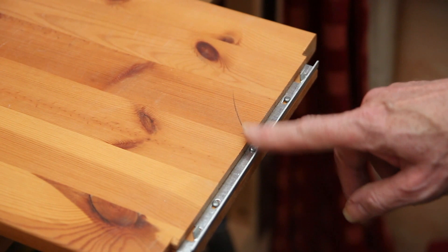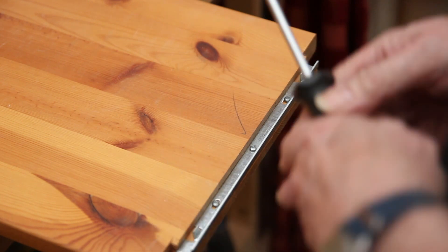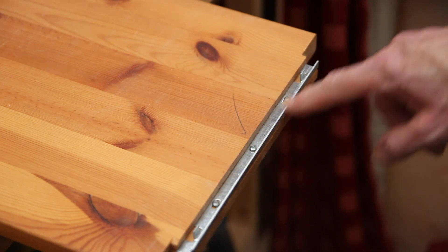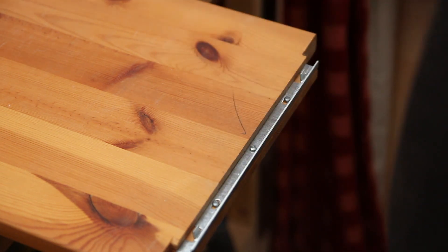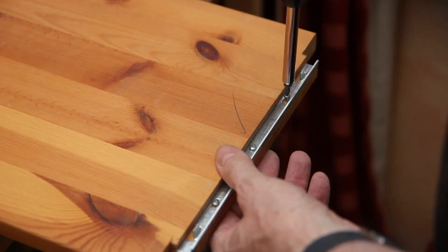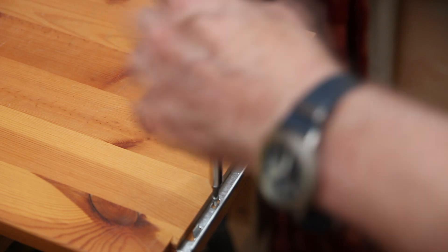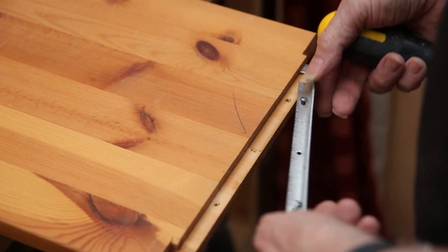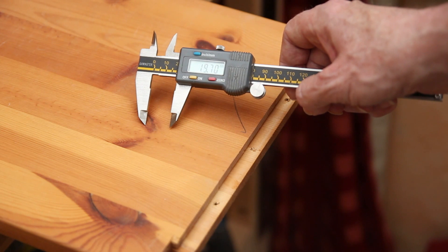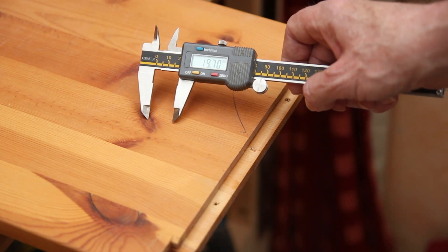I have to remove these metal fittings — the shelves all get suspended on pins that sit here, and there's a variety of means. These shelves must have been bought in three separate tranches. I think I've found enough of these longer boards, the slightly thicker ones, all at around 19.7mm, certainly close enough to laminate together without giving me steps.